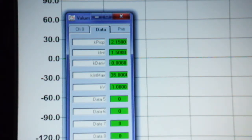And to load these values into the microcontroller, what I do is I put the gear channel to position 2, and I apply a throttle low, high, low, and we should hear 5 beeps as we get the 5 values read in. There we go. And then we can confirm that by going back up to position 0, re-enabling the motors, and you'll see that those values had not changed, so that they actually got written back to the computer, so we know that those values are indeed what I programmed in.